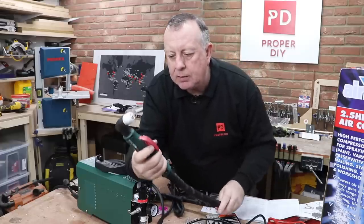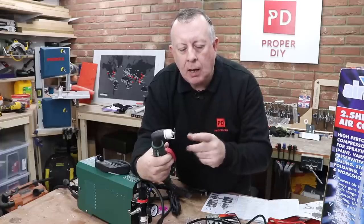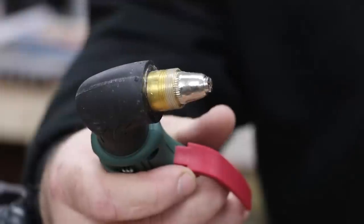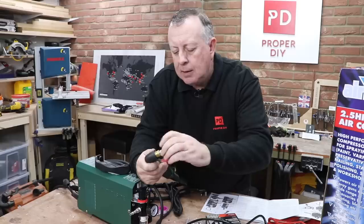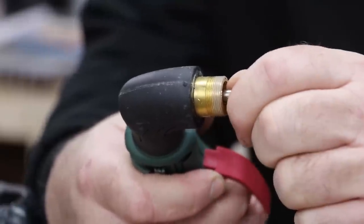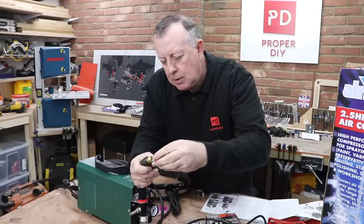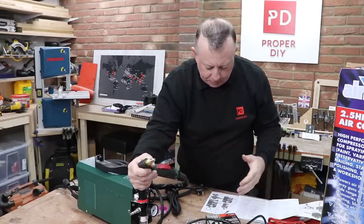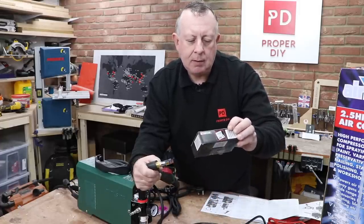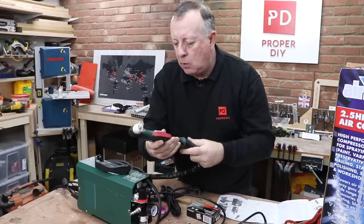Now the dangerous end is this really quite nasty-looking nozzle. The other thing I've worked out is that as you cut, this nozzle can wear down. When it wears by one and a half millimetres you need to replace it. It has this shield thing that you can undo, and this is the actual nozzle that wears down - that unscrews, although I can't get it out at the moment. That's what the extra nozzles are for. The unit comes with two extra nozzles and two shields, and I bought another eight here with shields as well. So with that in place, it just gets screwed on there and now we're ready to go.